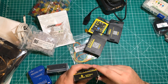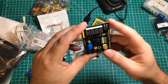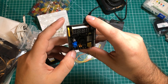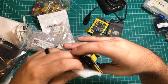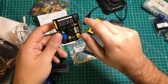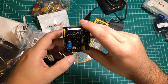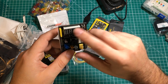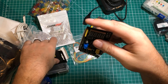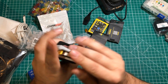This is the multi-purpose KeyStudio shield. I love these multi-purpose shields — what's really cool about these is they're a nice way to get a bunch of things hooked up without worrying about the wiring. KeyStudio is freaking amazing and they've got a wiki with example code. You've got a buzzer you just plug in, three buttons, extra pins, a potentiometer, seven-segment LEDs, LCD, serial for Bluetooth modules. If you're doing a thermostat you only need a couple buttons and a screen — it may have everything you need built right in.